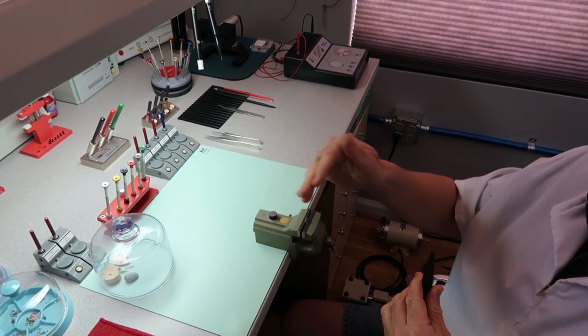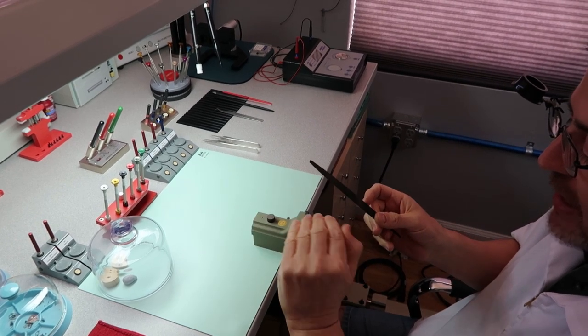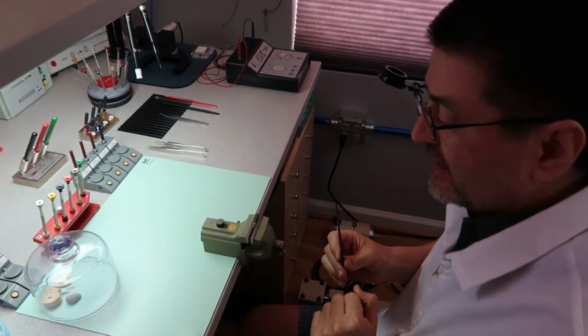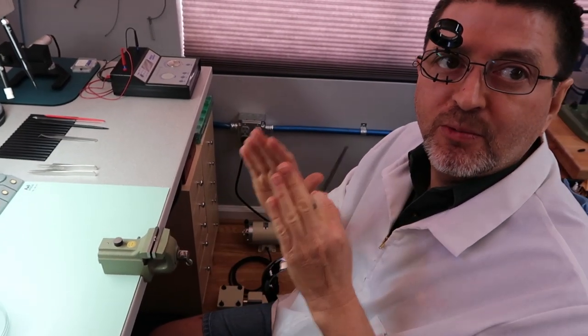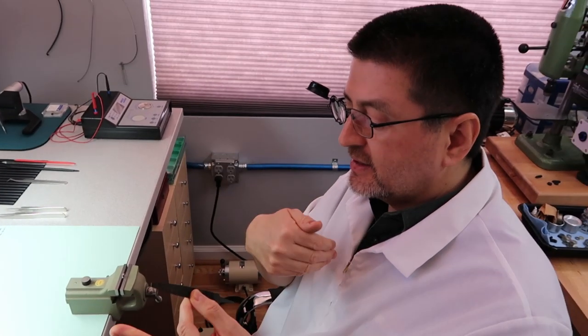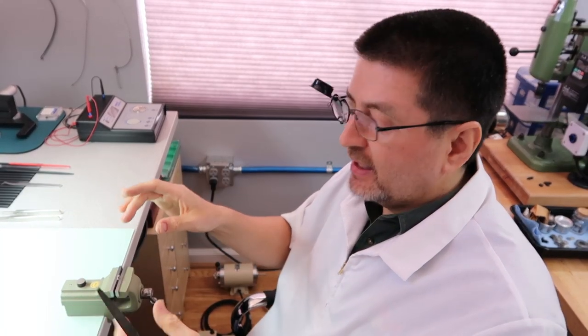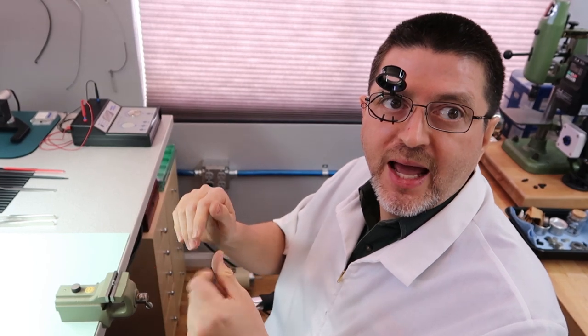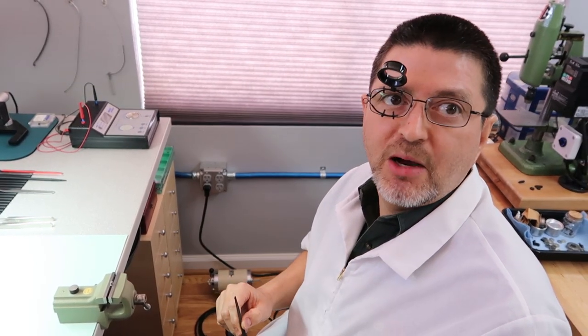The spindle OD. Right. And this has to be really slight. You'll barely see the radius, just enough. And then I'll complete this stage. When I'm done with this, we'll meet you back at the table, and then we're going to use the diamond stone, and deburr it and all that. Then we can go ahead and try to fit it into the spindle and see how we did.